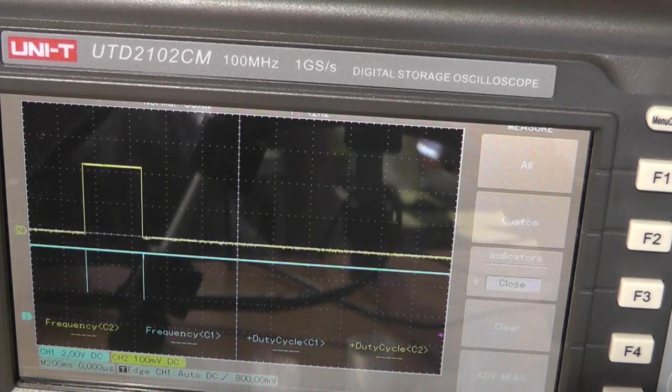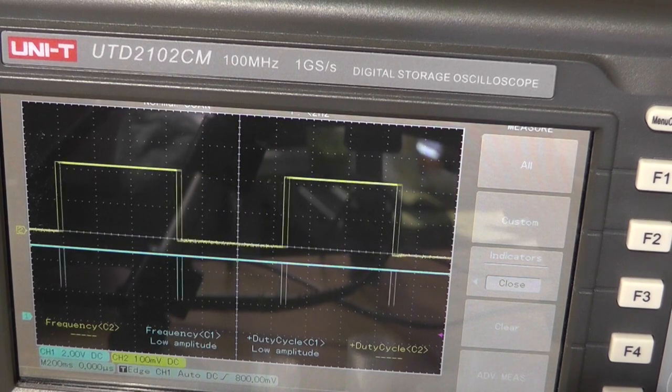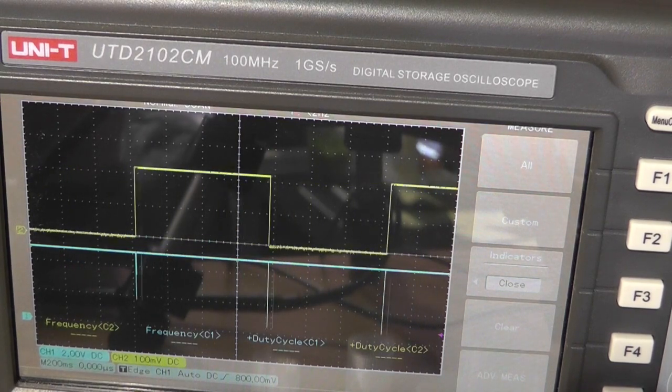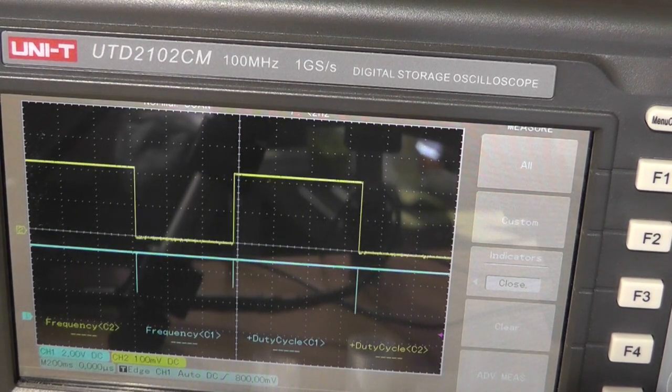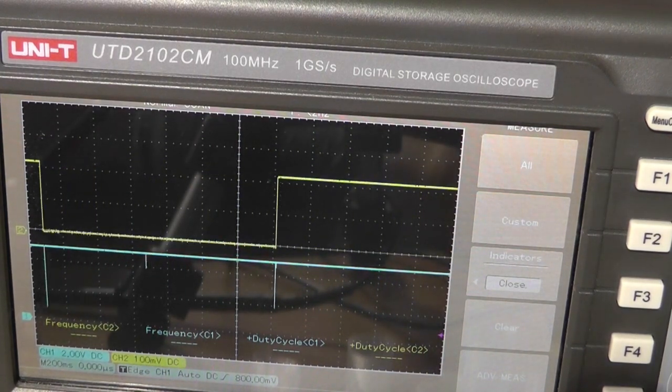So, with that being said, what that does is every other time the magnet goes past the Hall sensor, it triggers the relay to turn on or off, which in turn shorts out the coil and dissipates the waste spark. It's not needed to spark on the waste spark.